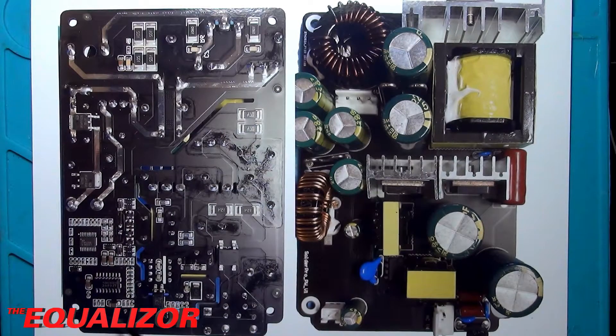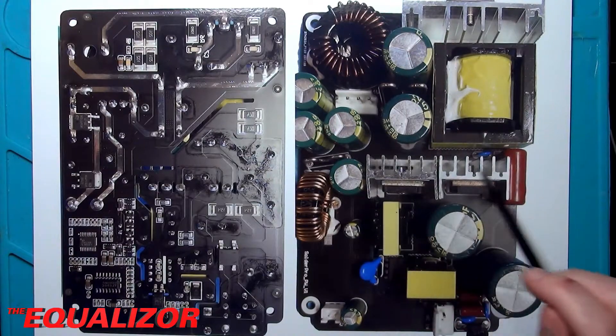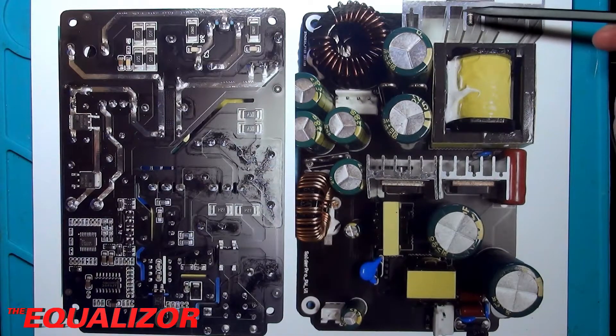The second part of this power supply is based on the TL494, and that's this chip here. That is a PWM power controller. This chip has been used for decades — I've seen it in lots of PC power supplies before, albeit in the through-hole variant. This chip is responsible for controlling these two N-channel MOSFETs up here, which drive this transformer here, and provide the 24 volts output into this diode up here. And this is a very, very chunky dual diode.